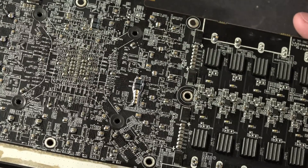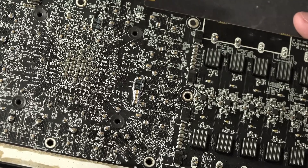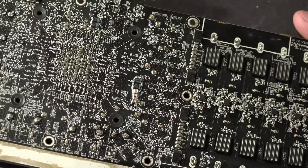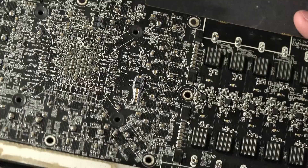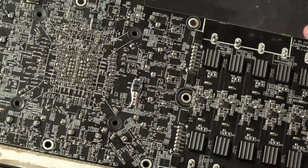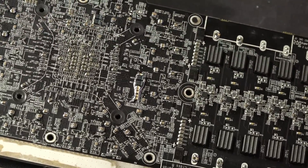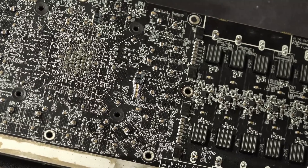They might be from the same series but just lower capacitance. I was looking at 220 microfarad, 3 milliohm ESR, optimized for super low equivalent series inductance — and they're like a $2 capacitor, because if you're not buying a thousand units bulk, you're paying a dollar a capacitor, which is just ridiculous. I have other really high-end Panasonic capacitors and I just don't use them on anything because they're so expensive, even though I've tested them to have more impact in terms of overclocking than some of the others I have.